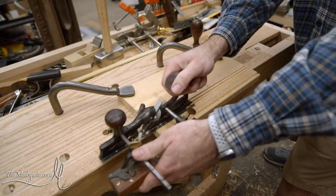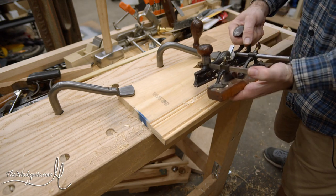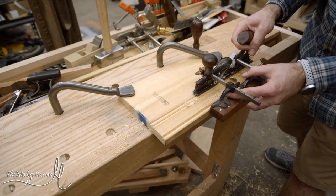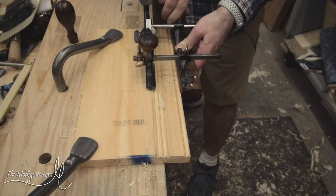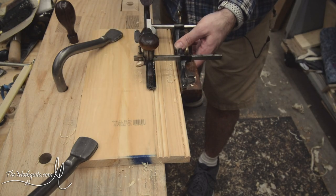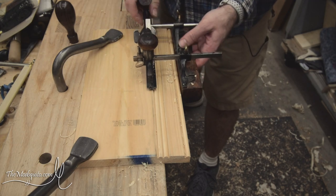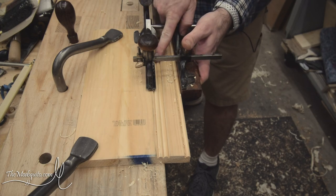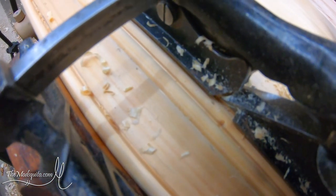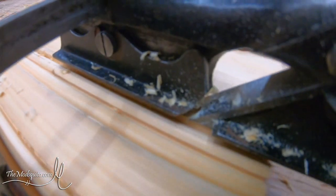I mean, that's basically beading, and if you wanted to do it again, we'll say go back over to the other side. That is the same process, and I actually find this way a little bit easier to set up. So if you do the leftmost bead first and then keep moving over to the right, that's personally what I find to be the easiest, just because when you look down in here, you can actually see where that iron is going to end up. And so that just kind of makes it a lot easier to basically line it up wherever you need it.